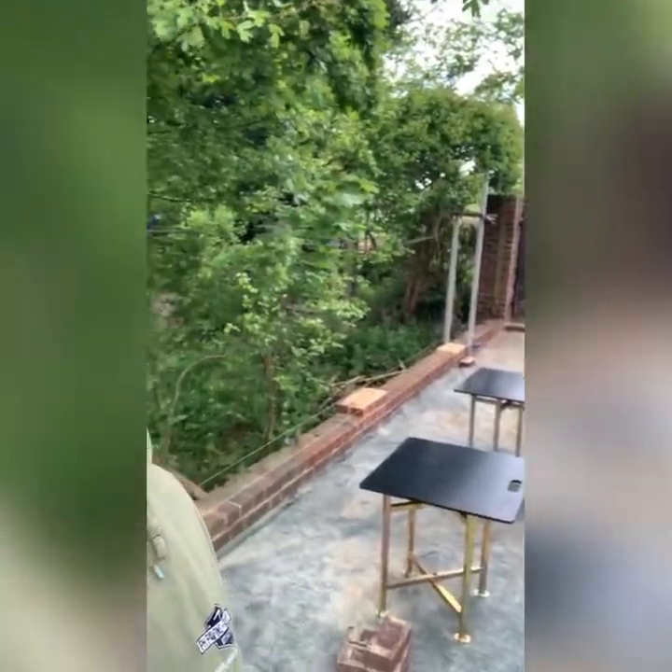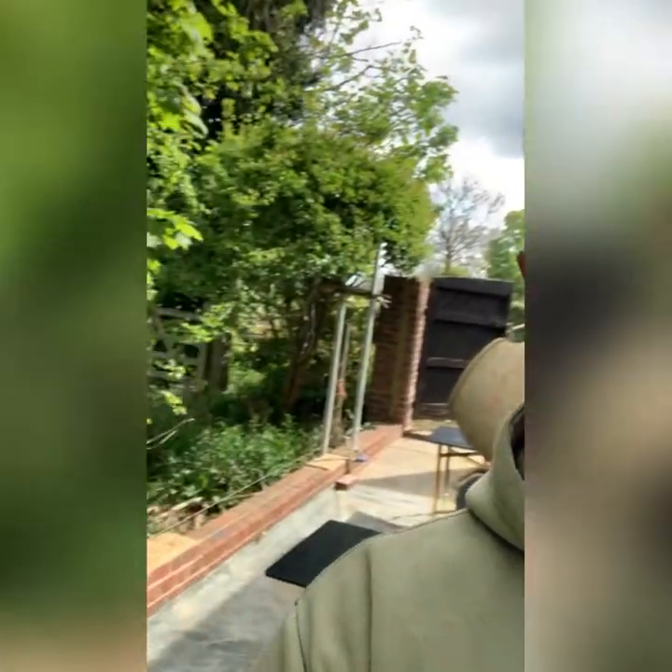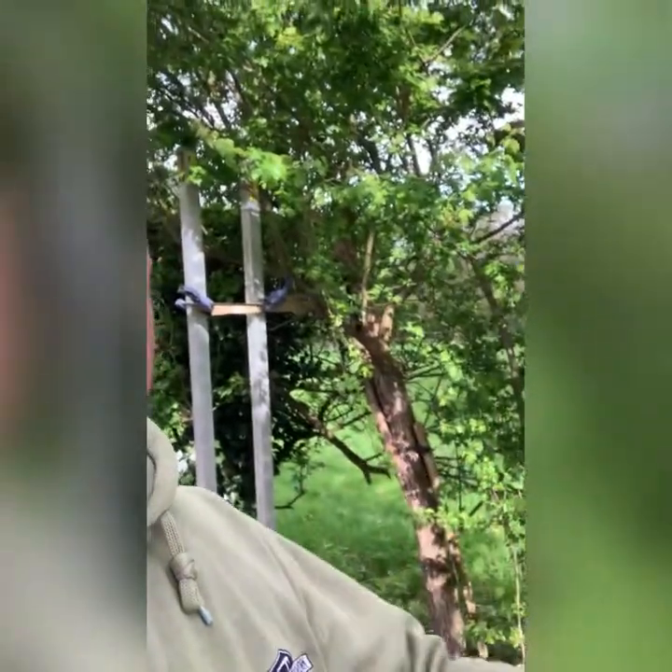Good morning. Monday morning, and you find me on my next job. This one is basically rebuilding some piers — three piers. They're only a brick wide, so it's two bricks long, one brick wide. The inevitable happened: being not very wide, they've got six-foot fence panels between them. You'd have thought it'd be quite sheltered because the house is literally here and this side is just trees and shrubbery, but the storm we had got over the fence panels and pulled all three piers down. So all I've done this morning is come in, set up, and put profiles up on the two end piers, then run a string line straight through the middle.